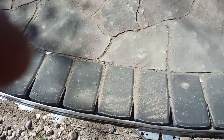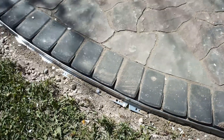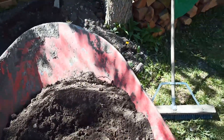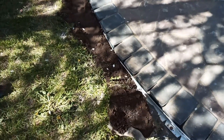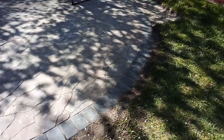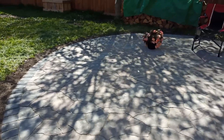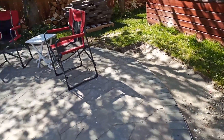You don't have to use mechanical compaction for the sand — you can just keep sweeping it in, but it takes time. Step back and enjoy your patio. Clean up your cuts as the last step, then backfill the edge — the grass will grow in super quick. This is the finished patio; the light was really bright that day with a lot of shadowing, so the camera had a hard time picking up how great it looks. You can see a little spot there for some future steps.